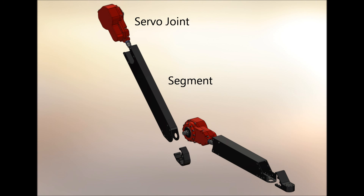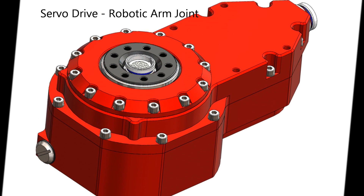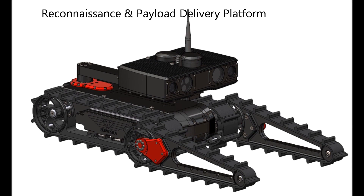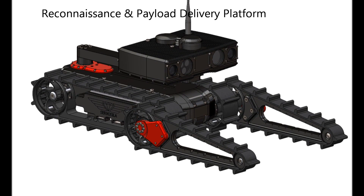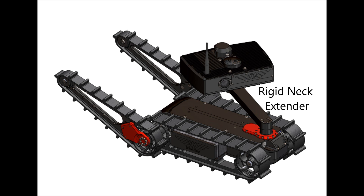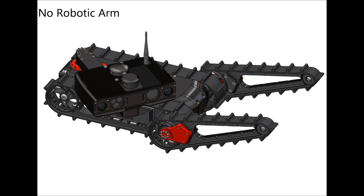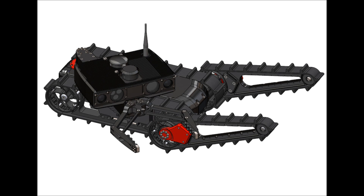The arm is made of servo joints and rigid segments that connect them. The more joints included in the configuration, the more degrees of freedom the arm obtains, and the more flexible a tool the arm becomes. In the simplest case, there is no arm at all, and the robotic head is mounted directly on top of the turret servo mechanism. A non-actuated rigid extender neck is needed to move the center of gravity towards the middle of the robot. This basic configuration is useful for reconnaissance, visual inspection, or for carrying mission payloads that don't require a robotic arm. It is worth noting that a gripper can be added to this simplistic configuration, primarily for delivering and dropping objects at desired locations.